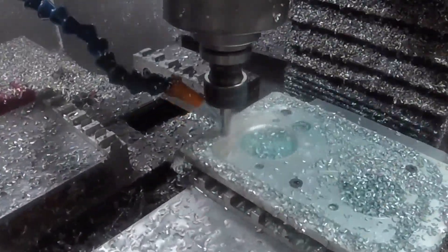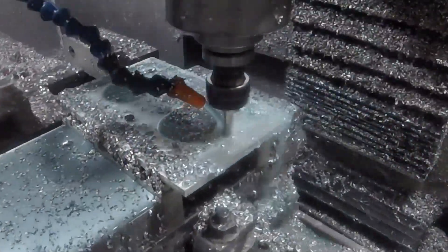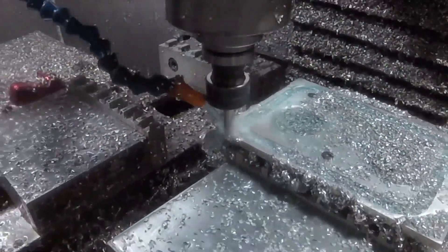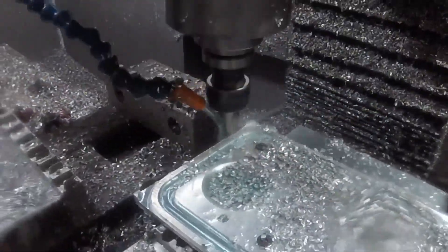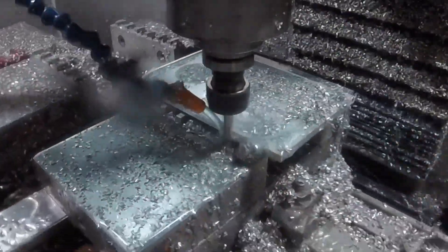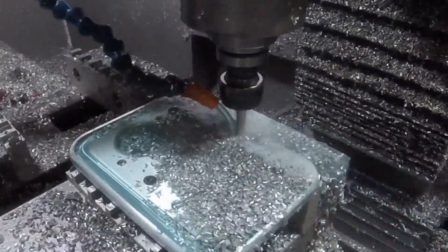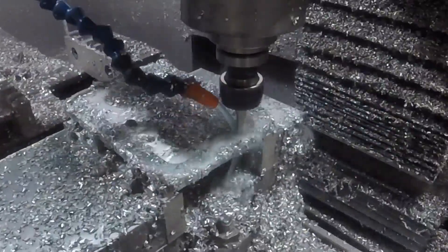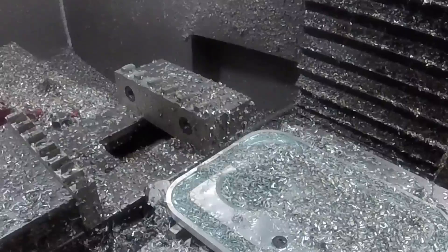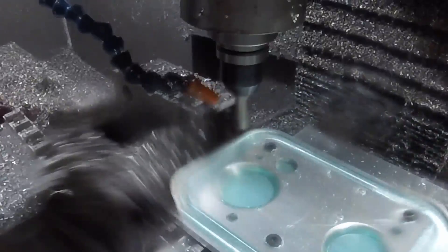I cut those two pieces apart and mounted the bottom to a simple fixture plate I made. Here you can see we're cutting the recess for the air filter itself and also the perimeter — just roughing it out. Since the air filter is an inch and three-quarters and I only have two inches, I need to get the material where the air filter sits to just under an eighth of an inch so it'll all fit together and gives a place for the air filter to locate into.